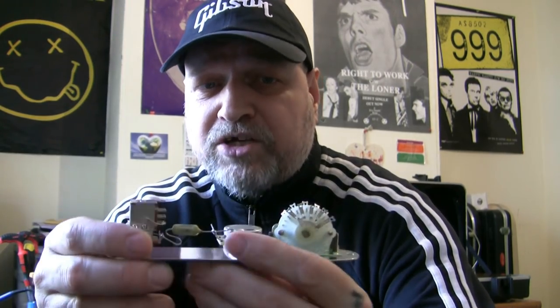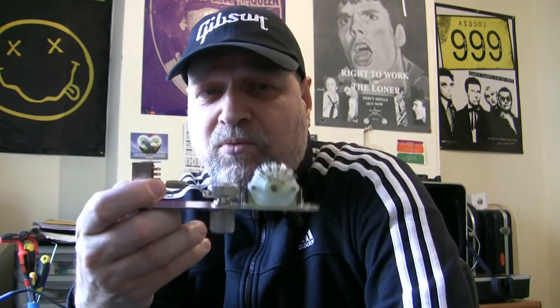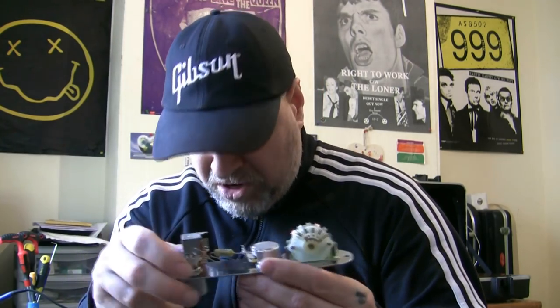And what I'm going to do is swap, I'll put a resistor in there, not a resistor, a capacitor. I stock Mullard Mustard capacitors. These are old, new old stock. And I'll put a 0.022 in there. I'm going to change it for 0.047, I think. I could leave it in there. But what I'm thinking is, I'm going to go just with a standard Telecaster wiring, just with the push-pull. And hopefully it won't change too much.